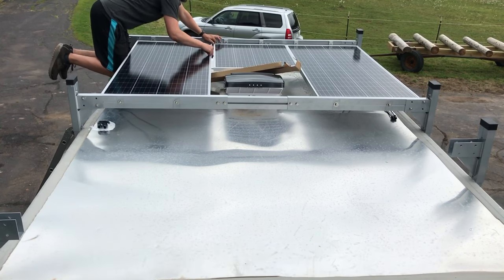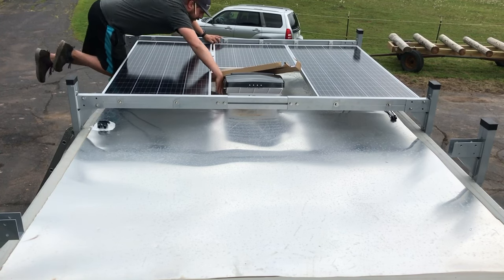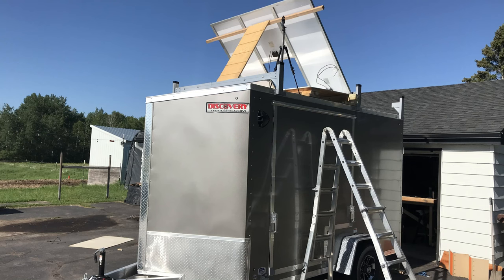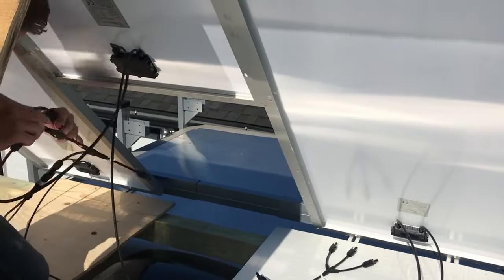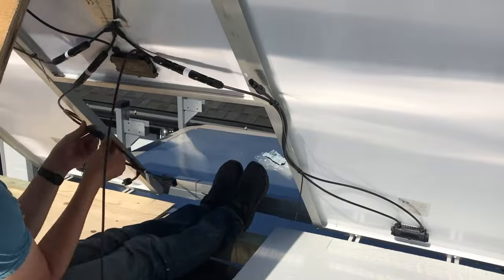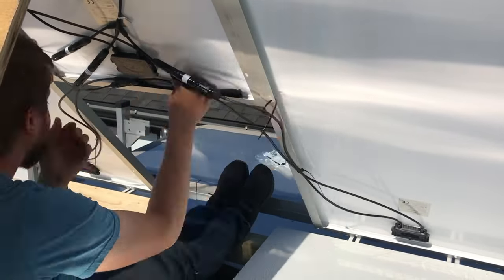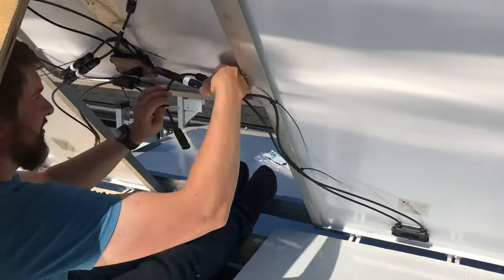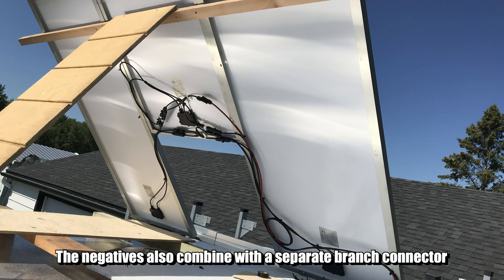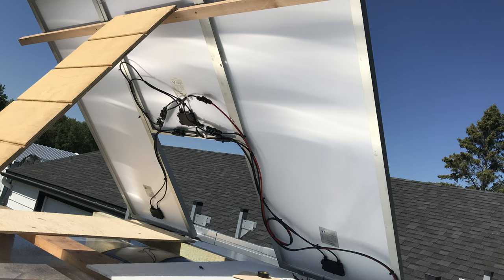So if it were tipped up and I could get to the bolts and wire — man, that would be so much easier. So that's what I did. I didn't have angled aluminum, but I did have some lumber. I've got the panels securely propped up and I've got some boards and plywood laid down so I can work on things without damaging the roof. Now I can get to work on the panels. This next part involved a lot of zip ties. My basic idea is to run the wiring on the frame of the solar panel and avoid having any of the wiring touching the underside of the panel itself, because there's going to be a lot of heat there and it's only going to make the panel less efficient. Each positive wire from each panel goes to an inline fuse, which then goes to a three-way branch connector. They then combine to one wire, which will run to the entry gland and go into the trailer.